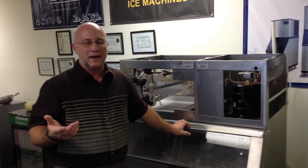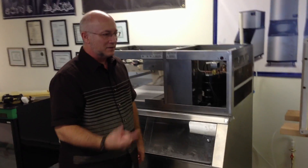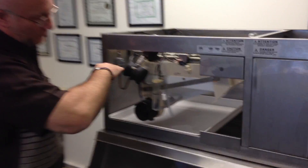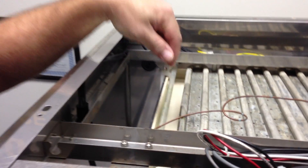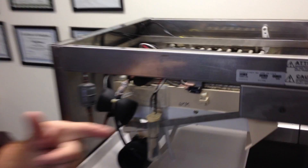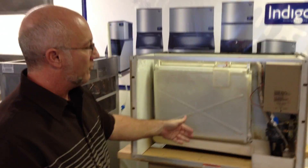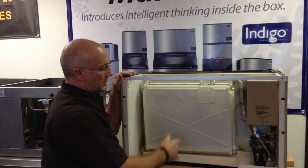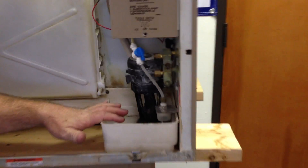Let's take a look at what happens if you don't clean your ice machine. This machine here has a horizontal evaporator, so the evaporator is oriented like this and the water trough is up top — that's why we pour the cleaner in here. Over here is a vertical evaporator machine, where the ice cubes are formed right here and the water trough is typically down here.